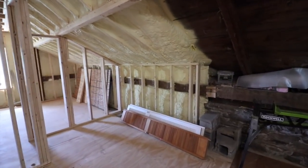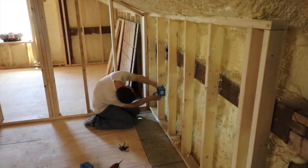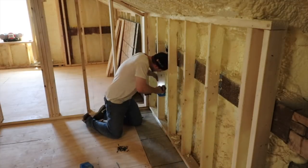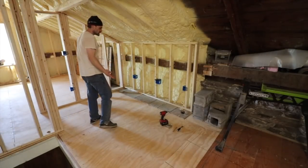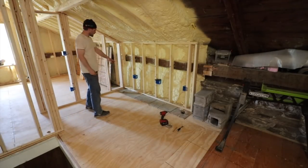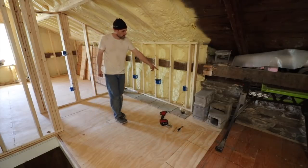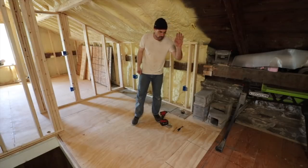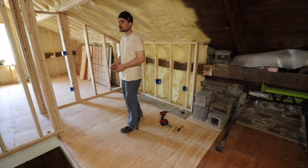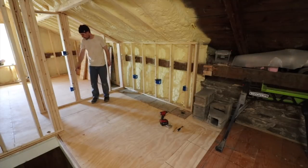I think I'm gonna go ahead and do the laundry room area. It should be rather simple. To recap the laundry room area, basically the washer and dryer, I've got the bigger plugs for those because they're 240 volt or 220 volt. And then I put another plug on the very end. That would be good, easy access for this area. We got another plug in right over there. So obviously we're overdoing plugs, but that's okay. And then over here, I've got another plug. That will be easy access.